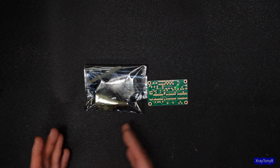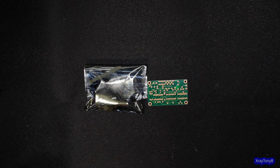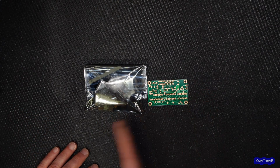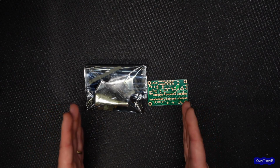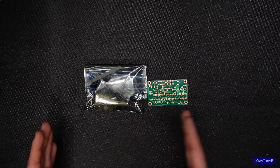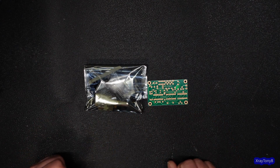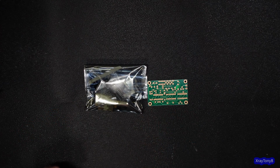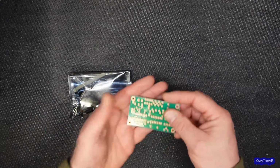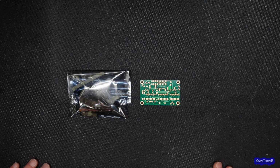And you do that by using shift register ICs, which are very common and cheap to buy, and a clock. You create a clock with a certain frequency, and you can make that pretty exact frequency spectrum. And if you do it with enough steps and you put the right filtration on it, you can get a pretty good representation of a pink noise signal. That's what this is doing. And it looks deceptively simple, this tiny little board. The math behind it can be, at least to me, a little bit confusing.